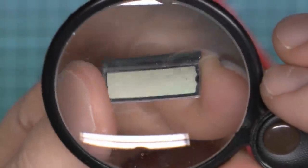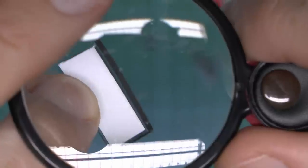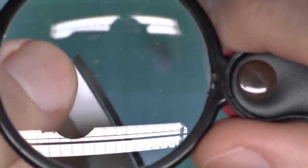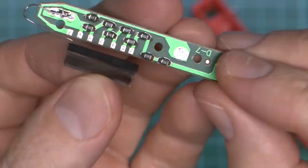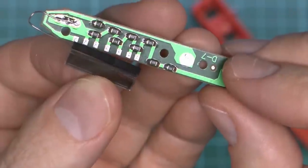There's the LCD there, so a little tiny item, just a reflective backing, of course, no lighting or anything in it. And there's just a little zebra strip on the back. This one appears to be all black, so pretty much difficult to see the segment lines inside, but it'll be the same as on that digital clock that we saw, so it's going to have conductive paths going through that. And of course those would line up with the conductive pads here on the edge of the board, so basically it just presses on those to provide a connection through to the front.